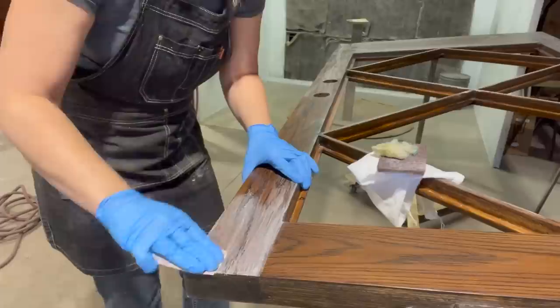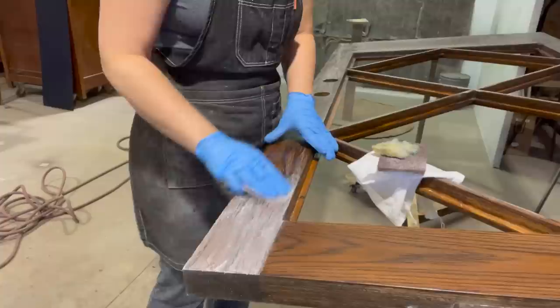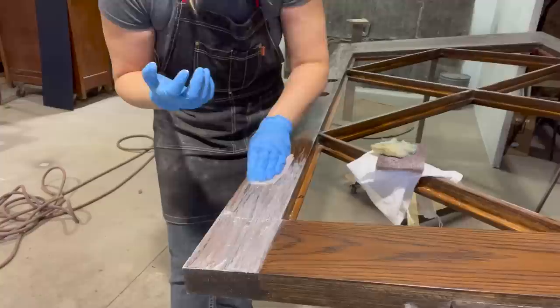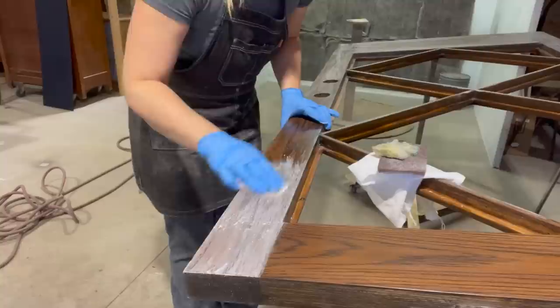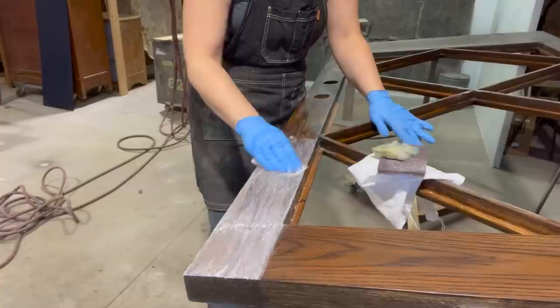And this is 5 coats of varnish that we ended up going, so there is lots of varnish here to work with, but you still don't want to go through a layer because, unlike lacquer, varnish does not cross-link or amalgamate or combine with the previous layer. So each layer of varnish is its own. And if you go through one layer, you can kind of see it like layers of paint that you never peeled away properly. You can see that edge there where the varnish was sanded through. So you just want to be really careful not to do that.